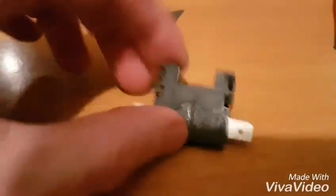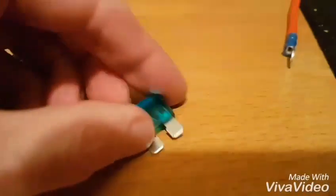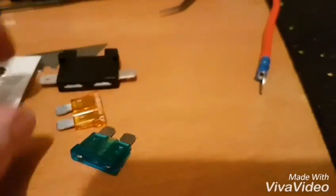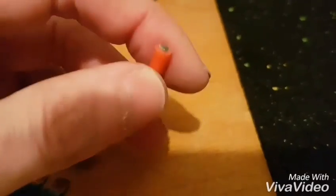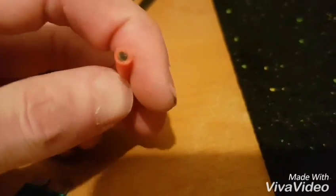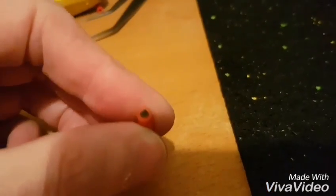This whole setup was about £1.52. The fuse holders were about 50p each. It is definitely worth doing the cable upgrade — 12 AWG, the kind used on drones for the battery. You can see how thick it is; that is a lot better than the cable that came with it, which was getting hot.